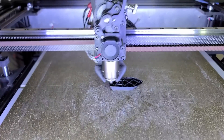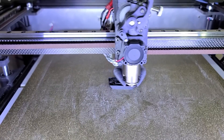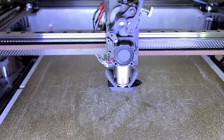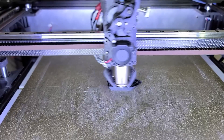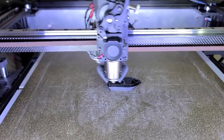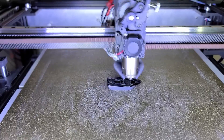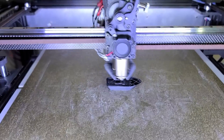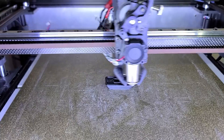I've also redesigned the cooling dock — the fan dock. It builds more pressure so the flow is better and it aims better than before. That's a big upgrade. Also, the 5015 fan at the bottom rear is now overvolted — it's running 24 volts and it's a 12-volt fan, so it's running at twice the RPM.